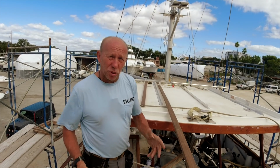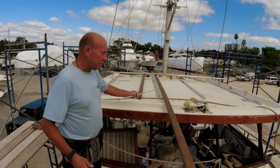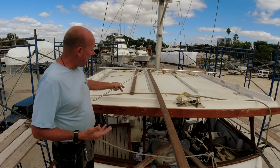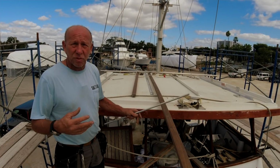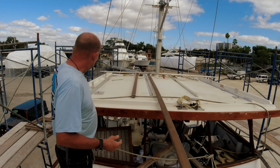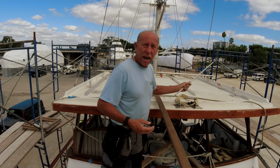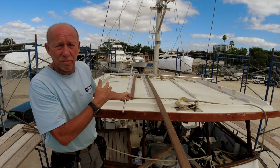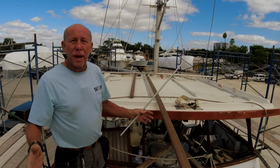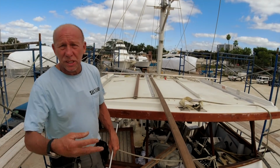We had another question about how I managed all the cables with sliding solar panels, 340 watts each. What I did is, by using aluminum rails for the slides and then UHMW slide material, the solar panel is isolated from the slide. So each wire is connected to the positive and negative of the slide as a bus bar on each side. So I have 3 panels, positive, negative, 3 panels, positive, negative, and then I can series and parallel them down the engine room based on how those panels are situated based on where we are. So I utilize a bus system, only 4 wires for the complete system.